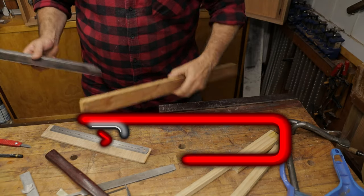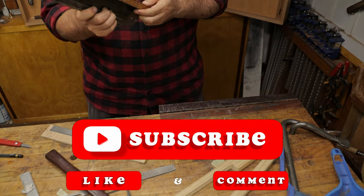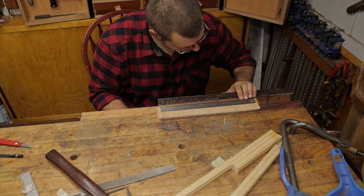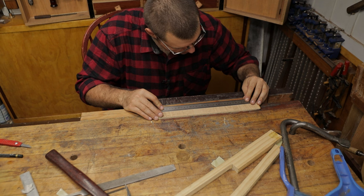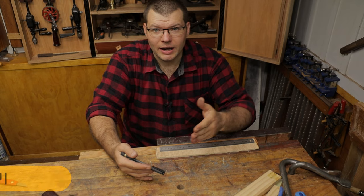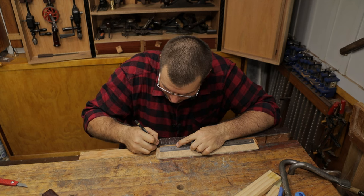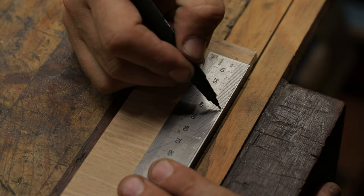Now that I've filed that off, I want to put my saw into my saw holder — a piece of wood. I want to set it loose like this and bring this flush with my ruler, just to the right height, then lock it in place. Now as we're doing every two millimeters, I'm going to use one of these fine permanent markers and we're going to put a mark on the saw plate every two millimeters.